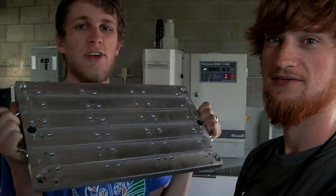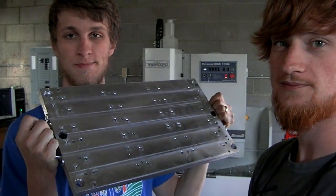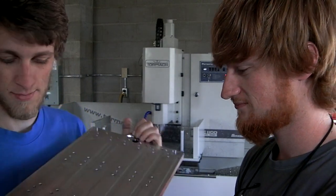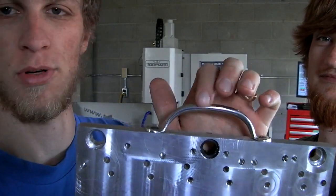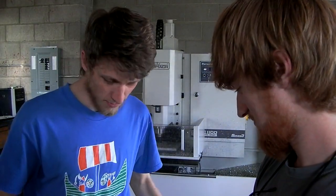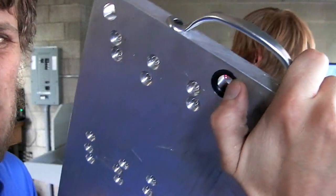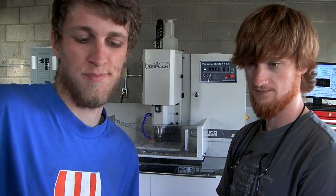This is a fully machined fixture for the Paramilitary tube — the Norseman one is going to look almost identical but we haven't made it yet. Today I stopped by Home Depot and picked up these handy dandy door pulls, and they work amazing. This thing's heavy and the handles just make it awesome. In the back there are pressed-in alignment pins — so every time you put it back on the machine it's totally repeatable, it orients itself the same way every time.